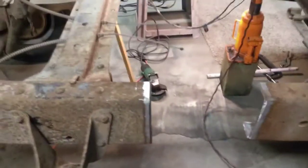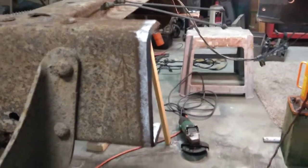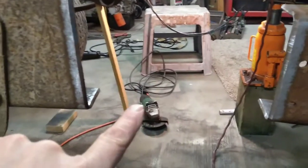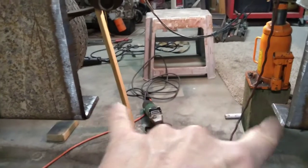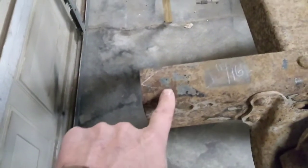Flag time to everybody who's been following along here. I just went over and took the measurements off of the short bed that I'm going to put on here, and these dimensions that I have this thing cut at are not correct. So what we've got to do is take this another 1 3/16 inches off right here. So I've got my new scribe lines there. Your total measurement on this cut should be 16.5 inches. Okay, and that means that back here at the back, I'm actually going to have to add that 1 3/16 inches back on. So your cut at the back should be 3.5.